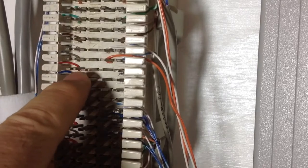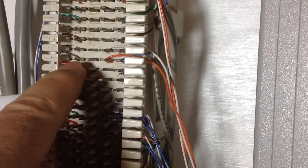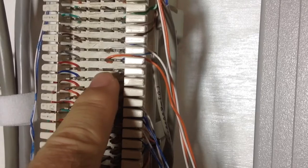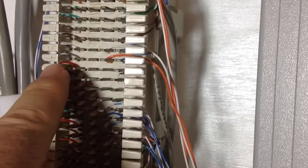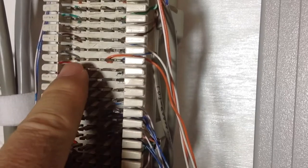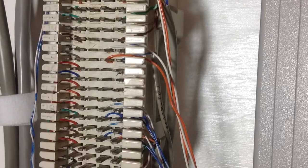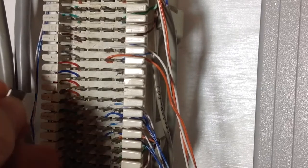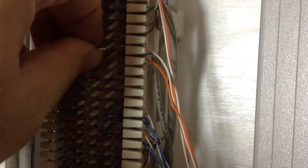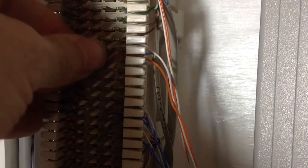See if I can wiggle these two simultaneously because they're connected. Now on the other side are two more pins, but they're connected to each other, but not across. So in other words, there's not a continuous connection all the way across. There's a shared connection on these two, shared connection on these two. So what a bridge clip does, literally, is bridges all four of the pins together.